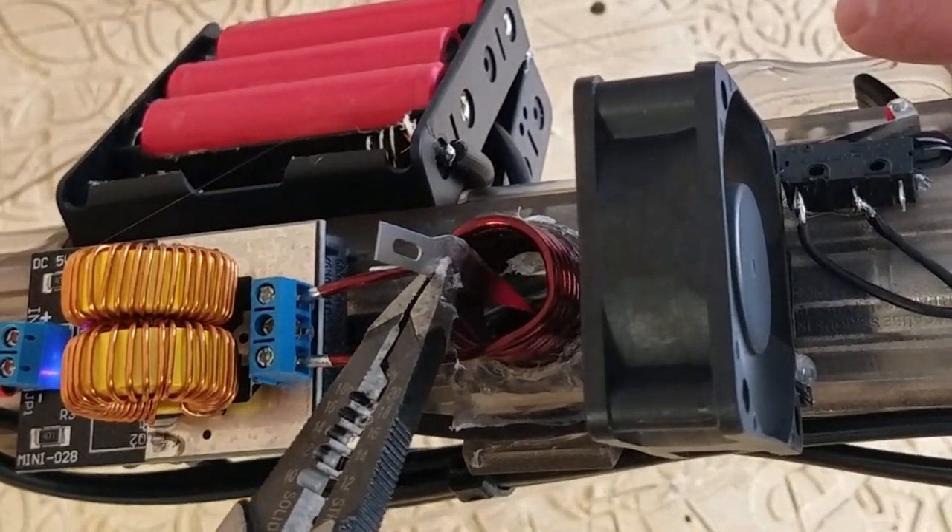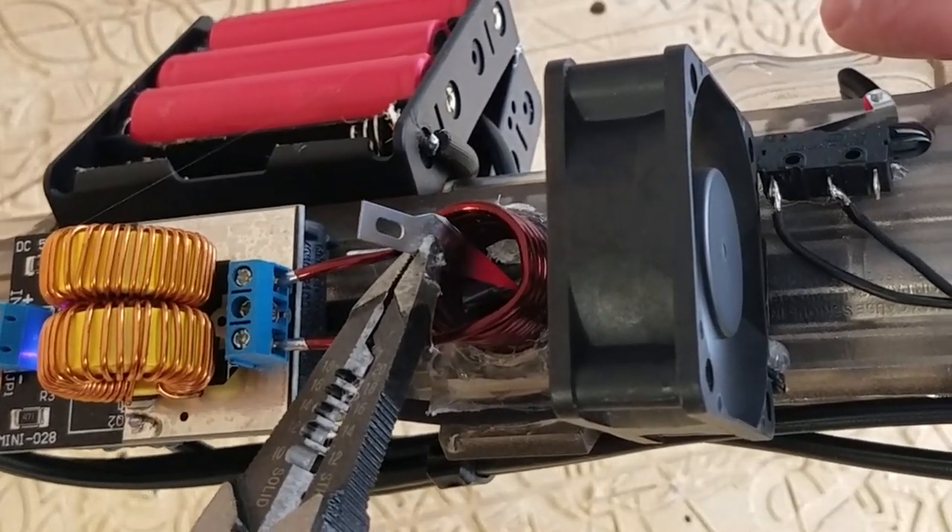The main challenge is finding a way to heat hot glue from the inside out. This is where induction heating comes in. Induction heating is the ability to heat certain metals with a magnetic field without physically touching them — it only works on certain types of metals. You could stick a piece of steel into a coil and watch it glow red hot, then stick a piece of hot glue into that same coil and nothing would happen. That's why I put a piece of metal in the center of every hot glue ball — so I could heat it from the inside out. The metal is heated by induction and passes that energy slowly from the center toward the edges. The trick is to cook it for just the right amount of time so the exterior doesn't become too soft or sticky, but the interior becomes hot enough to explode and release its hot glue on impact.